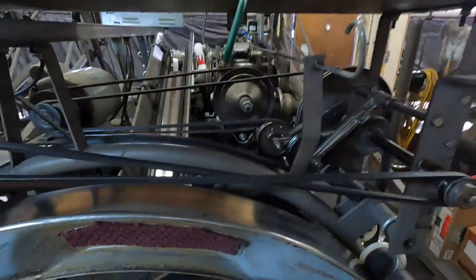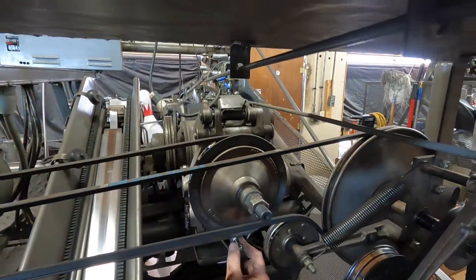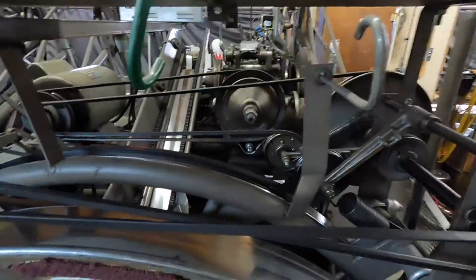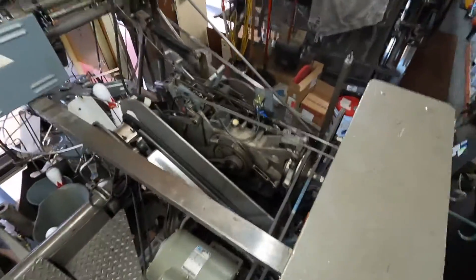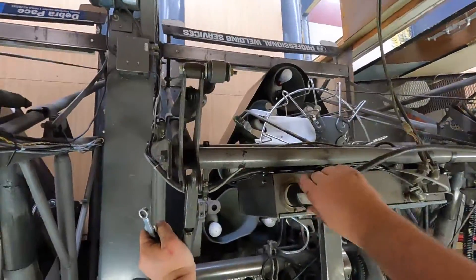The tools you'll need are two half-inch wrenches. You want to make sure that your jam nut under here is loose and backed off plenty. This should not have changed from your previous adjustment number eight when we went through and did the follower adjustment. Now, this is going to be the one and only adjustment where it's okay to not have the machine unplugged and the breaker off, because this adjustment does need to be done live.